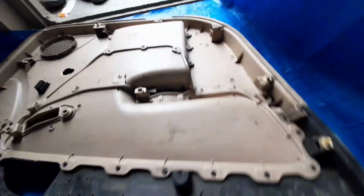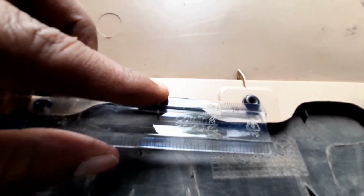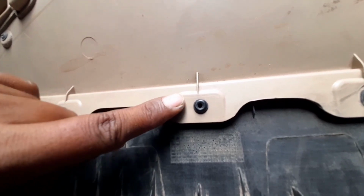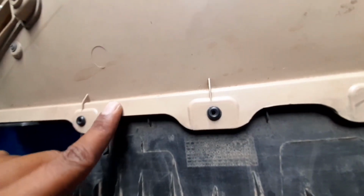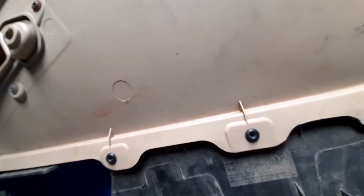Now if you go for the welding purpose, this one is the welding cylinder. Whatever the diameter of this welding cylinder is before welding, we need to see, and after welding, what rivet size will be formed, that also needs to be checked. Then next one, whatever flat surface is created, if you see, this profile will be different, and here we need to create that impression and depression. Now this one is the impression, all above your base profile we can say is an impression. If somewhere it is below that profile, then we can say it is a depression.